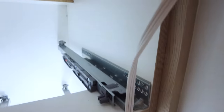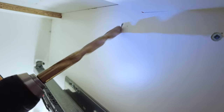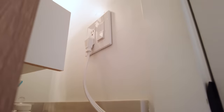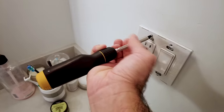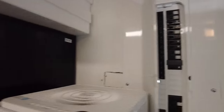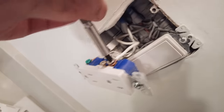Now on this side, I like to run the wire straight down from the outlet, so I have to drill here. It's so tight — how am I supposed to hold the camera and drill at the same time? We are through. Now how am I going to pass the wire up there? We take the plate out, use the driver to remove this. We are in. I forgot the live and neutral are on the side of this thing — never grab it like that. Turn the breaker off before working on outlets. GFCI works when you place your body between live and earth, not live and neutral. It is safe now. Let's remove the outlet.